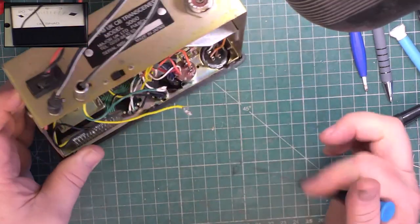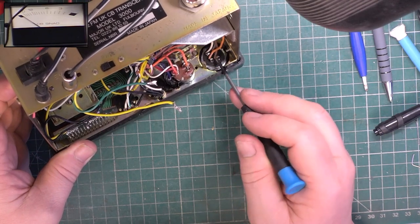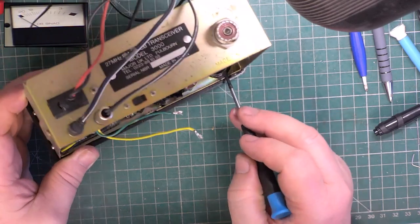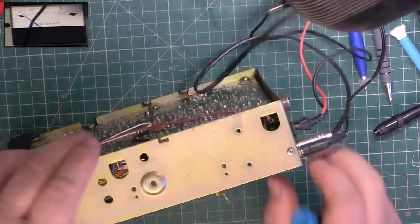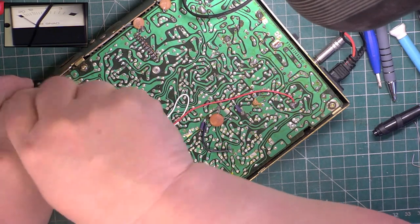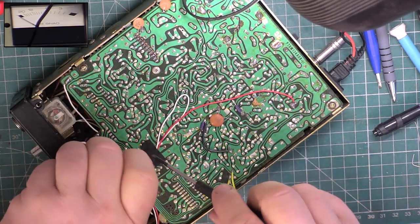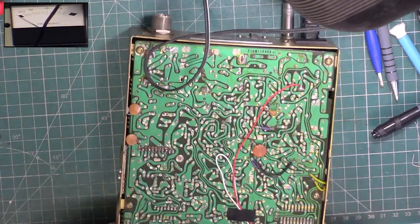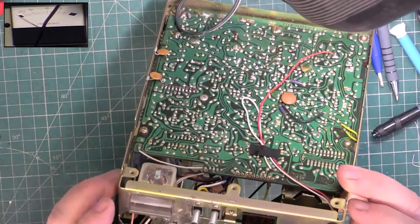See, you've lost all the decoupling capacitors from the microphone socket here. So that's been messed with. It may be that you've got to unsolder the microphone socket to take the front off. The moment there's enough wire, there's no shrouds there, which there should be.